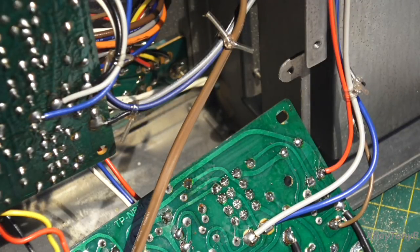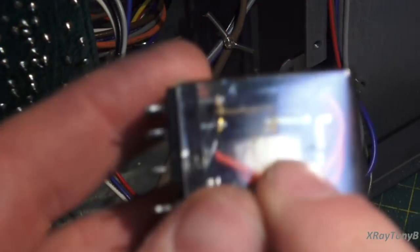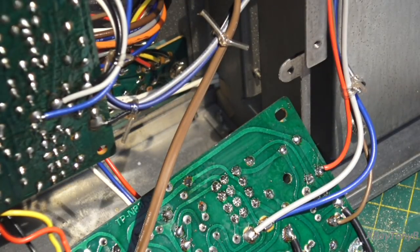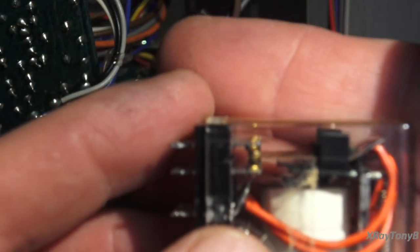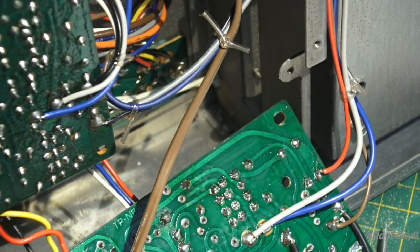As I mentioned in my Q&A video, try not to turn this receiver on with the volume turned up very loud. Obviously all that power comes out of the speaker terminals, goes right through this relay, and straight out to your speaker — which is a relatively low impedance load at DC. This relay can hold the speaker current well, but when you're making and breaking that current, this is not a contactor — it's a relay, and it's really not designed to switch very high current for any length of time. Turning the volume down will probably help the relay last a little bit longer.